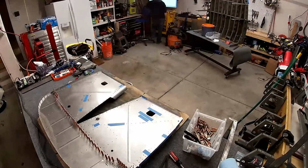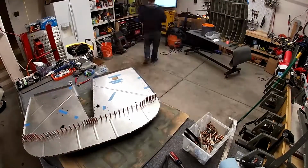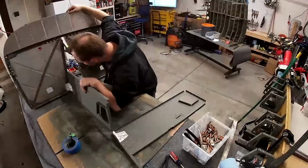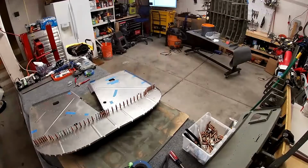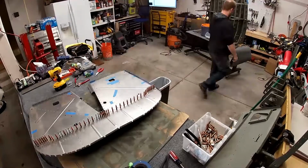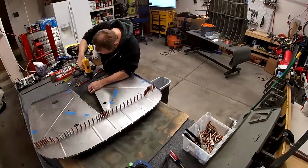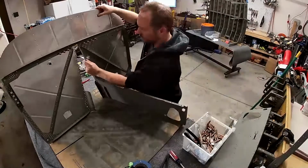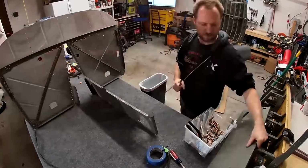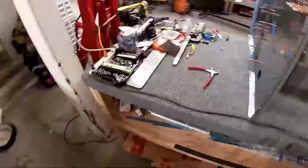Today was also a lesson in making sure you read the plans accurately, because as you're about to see, I'm realizing, oops, in a couple places where it says do not rivet, yeah, right there where I'm looking, I riveted, which means I will not be able to attach this firewall tunnel until I drill out these 2 rivets. So my bad. It shows you one side and then it says don't do this on both sides. So make sure that on both sides of the firewall, you tape off where it says do not rivet, because otherwise you will be me in the future.